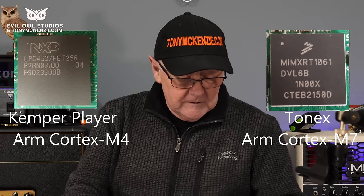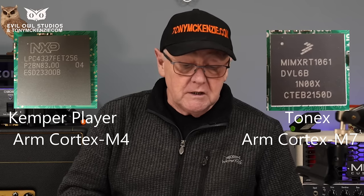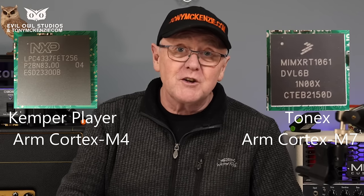It's got a Cortex M0 processor core, an ARM Cortex processor capable of offloading the main ARM Cortex M4 application processor, running at frequencies, as I've said, up to 204 megahertz and so on. On-chip memory, serial GPIO, state configurable timer, and more. Oh, that's it. That's the main processor. Scarily, it costs all of £11.93, or its US dollar equivalent. Where these are made, who knows what it costs, but if they buy in enough numbers, it will be cheaper than that.